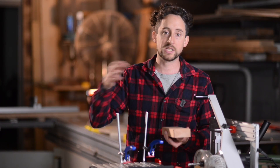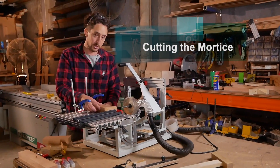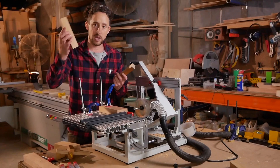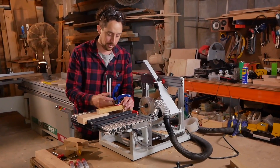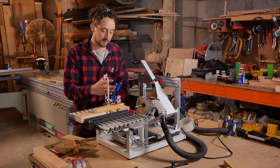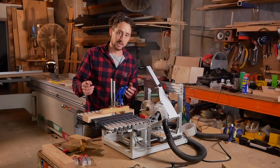Now that I've set the fence I'm ready to do my first cut, which is going to be my mortise. I want the mortise on the edge of the timber, so I'm placing it on the edge of the table and using the little red stops to line it up along with the fence, then clamping it in place. To get extra clamping pressure I use a spare piece of stock of the same thickness with a bridging piece, since these clamps can only work in one orientation. Once it's firm you can move the red paddles out of the way and we're ready to do that first mortise cut.